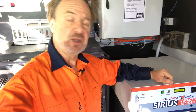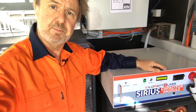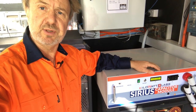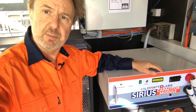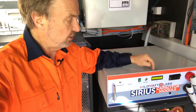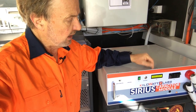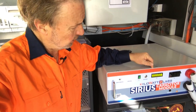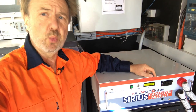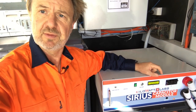It's also very happy to be cycled a lot. I've paralleled it with the Kilowatt Labs Supercapacitor, with shunts on both battery systems so we can measure the power flow into each. What's really fascinating is that the supercapacitor — this unit, which is a 3.55-kilowatt-hour unit with about 120 amps continuous power capability, but it'll peak way higher than that for short periods — it's doing most of the work.